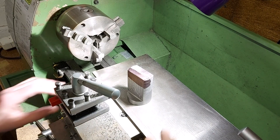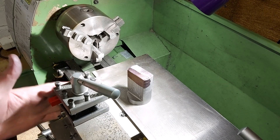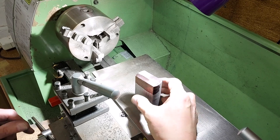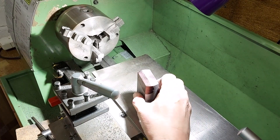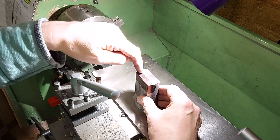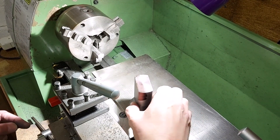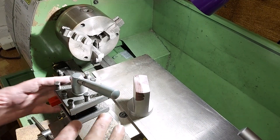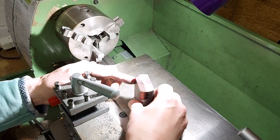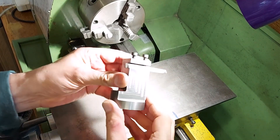The plan for my freehand turning tool is to have a piece of quarter inch steel plate bolted to the cross slide - I'll remove the top slide. I've got a piece of cast iron, two inch diameter, that I've machined down. The quarter inch tool will sit in a slot with bolts from the top to locate it, and you'll be able to move and turn it. With the top slide out of the way and the plate in place, you'll get a lot of space and support because this will be bang on center height.